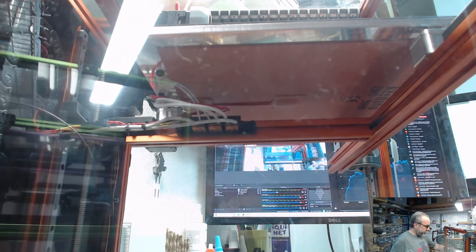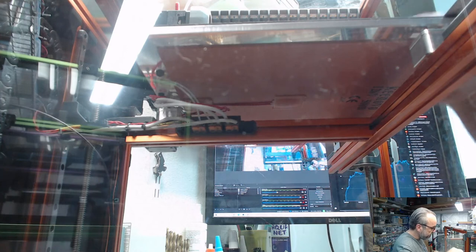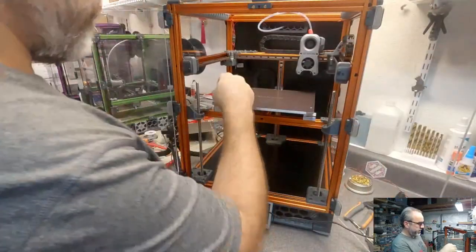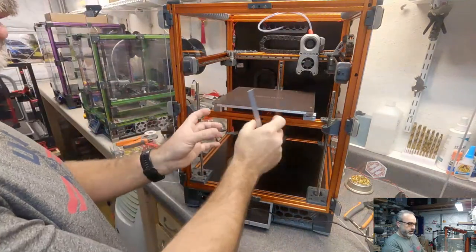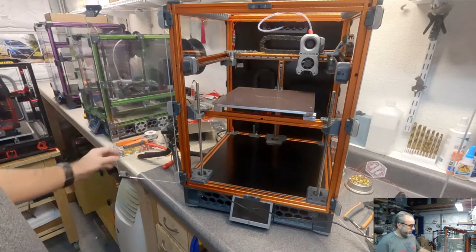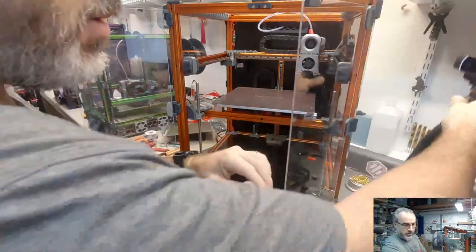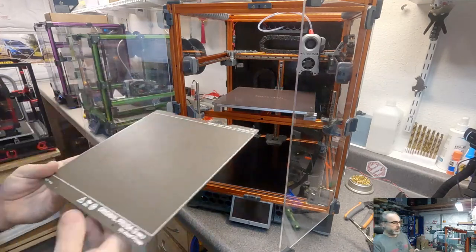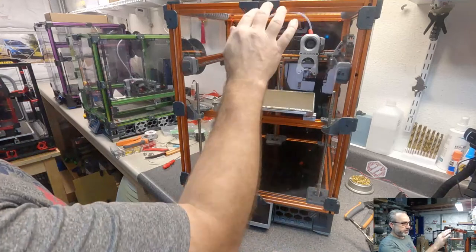All of this is good. I think someone, Low Tech Greg, had a good suggestion here. So let's see how we are. Yeah, go here. I'm just gonna measure. We're right at 80 millimeters there. We are within a half a millimeter side to side. I'm not gonna take all of this apart so I can adjust that half a millimeter. It'll be fine for now. Okay. Ground is attached, thermistor is attached, wires are managed. Bed is on, plate is about to be on. I think we're good to power it up.